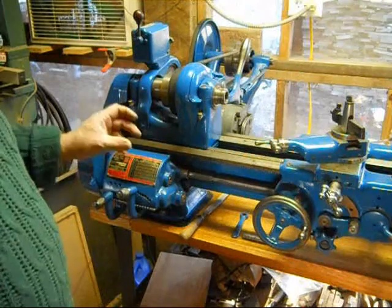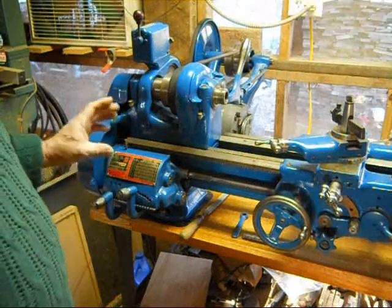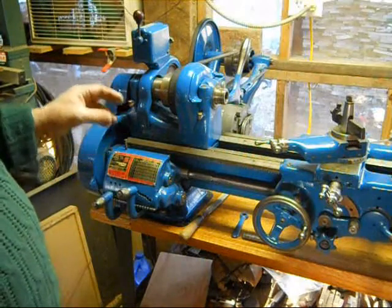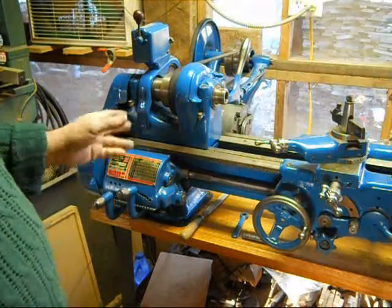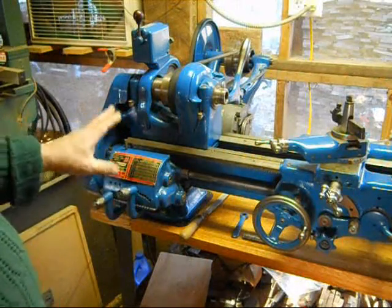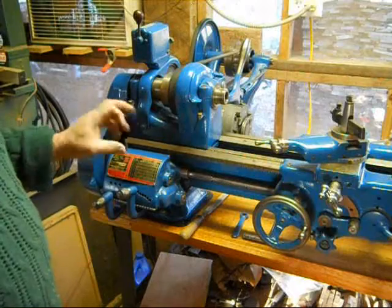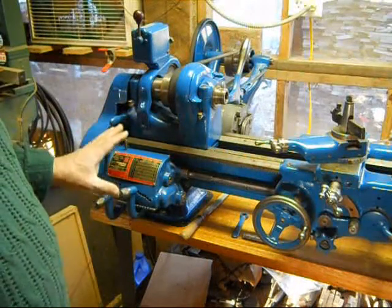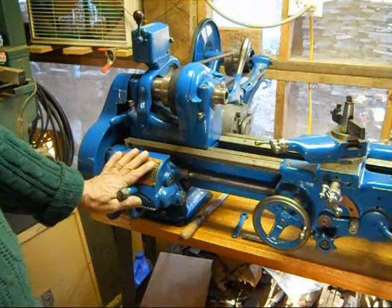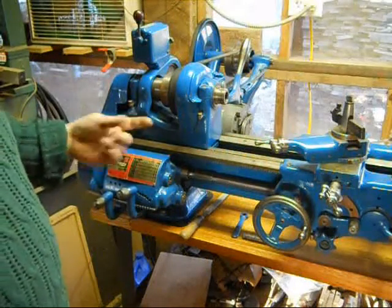And once I had it rotated in the right spot and it slipped over the key, it was very hard to get on. But I was able to get it on right. And even though the end of that key is a little bit chewed up and doesn't engage that tooth 100%, it probably does 50%. Once I had everything on that gear shaft and all the gears were in place and the big gear was pinned with the taper pin, I could rotate that by hand all the way around. So I decided, well, I'll put the tumbler gears back in and put the tumblers back on and try it. Once I had the gearbox totally reassembled by hand off the machine, in every position I was able to rotate that shaft 100% all the way around by hand.